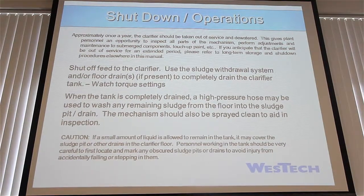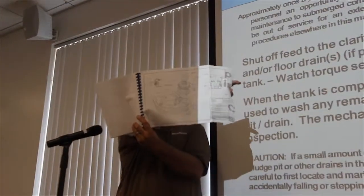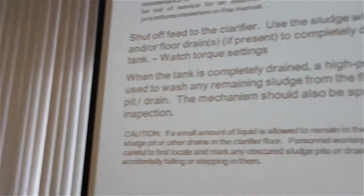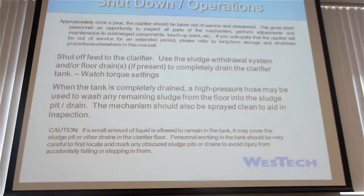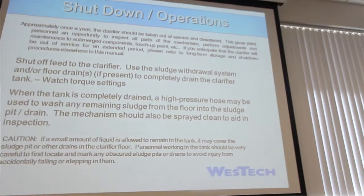Back here in the drawings of the O&M, there actually will be, where is it? It's the first drive drawing. It kind of looks like this. The number is really long, but you want to look at that one. It's ending in 1205. Right down towards the bottom, it will say direction of rotation. So this one is 0.003 RPM. That's how slow it is going.